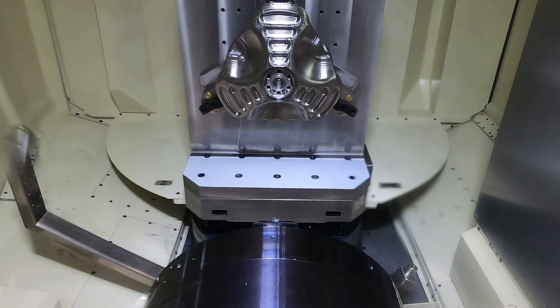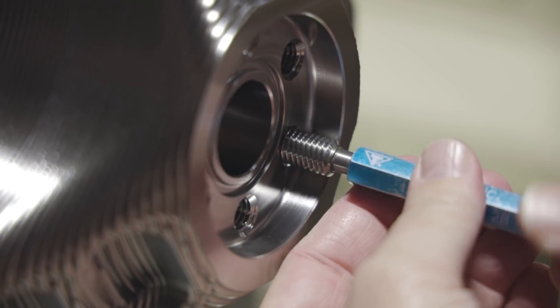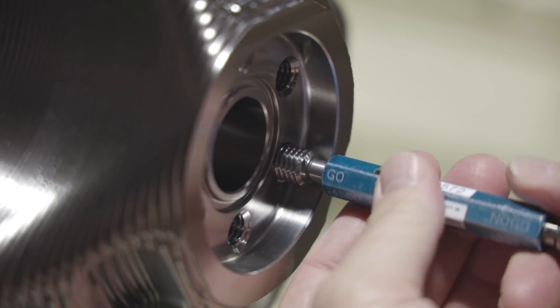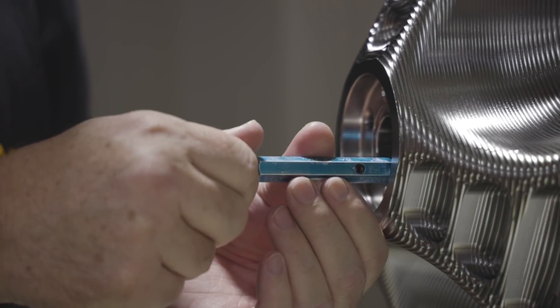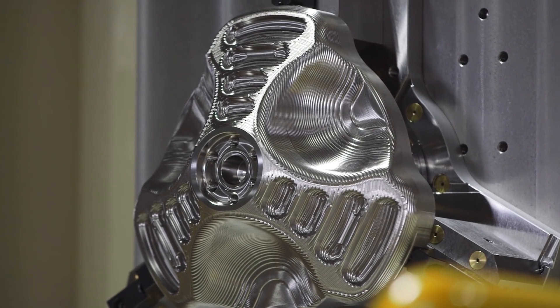This part is looking beautiful. We just finished the threads and I took the half-13 go/no-go gauge — sent the go in and it's a smooth fit, took it out, put the no-go in and it does not go. The thread is absolutely perfect. Those extra 4 thou in Mastercam overshooting the OD of the thread — that's what made it happen. Titanium machining, crazy aerospace parts on the Makino. All the small intricate work is done; next we go to 3D surfacing the entire part. Check out the next video which will complete the first operation on this massive titanium part.